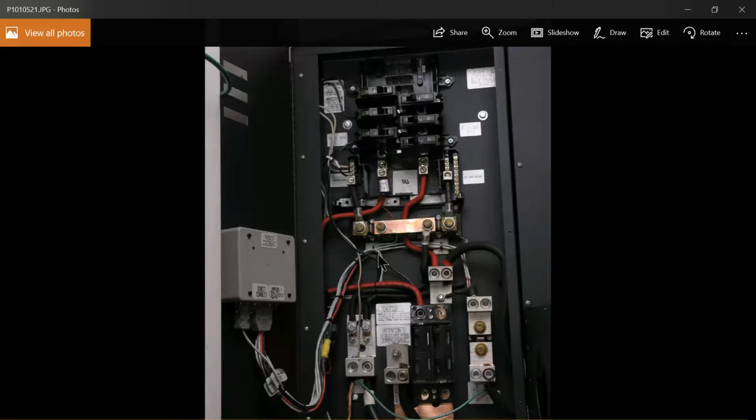So one possibility. So in other words, where I was going with that is you wouldn't want to take that number 10 wire a long distance over into another part of the house where it might be more convenient to meter. You'd want to be bumping it up to something heavier than a number 10 with an extended wire run. So I think we'll just skip that concept and keep the charge controller nearby here, if not on the cabinet, on the wall next to it with some conduit between the two. And you could use liquid tight flexible conduit or something like that.